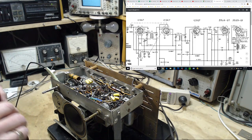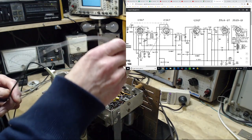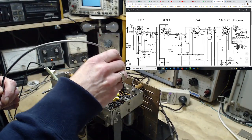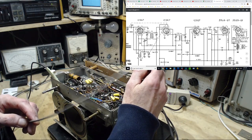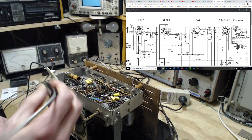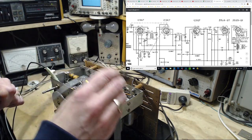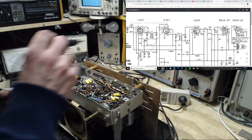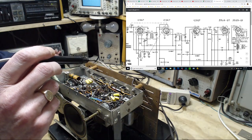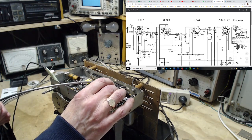5 volts full scale. Now the grid on the L6 is pin number 5, next pin. So this would be the grid here. This might make some sound in the speaker. No? And what do we see on the meter? Hey, there's nothing much happening there. So it's tricky reading the voltage of a grid. So I shouldn't read the grid, I should read the cathode. The cathode is biased positive. Yes, Jim, that's what you should do. So we should see a positive bias voltage here, which really is a negative bias voltage right here.